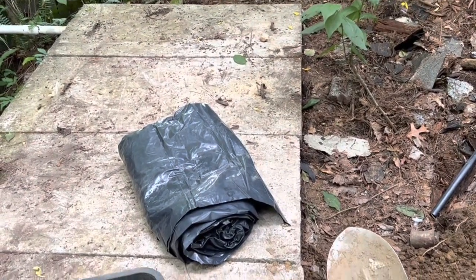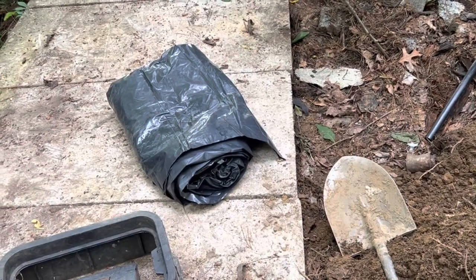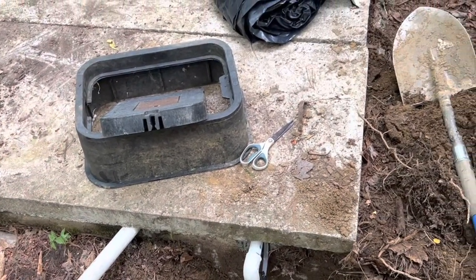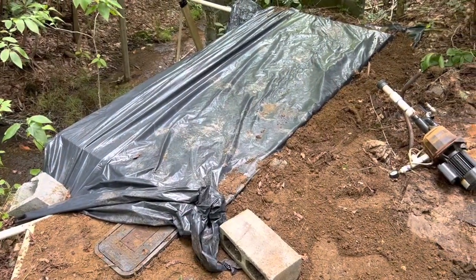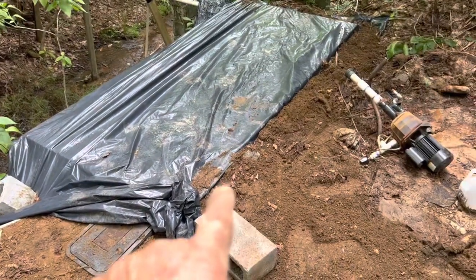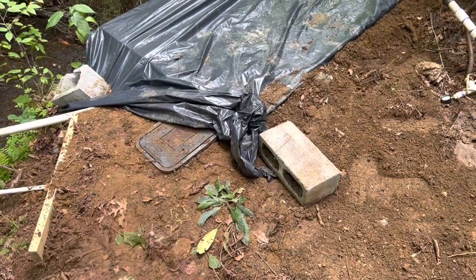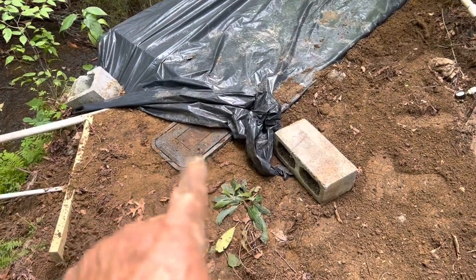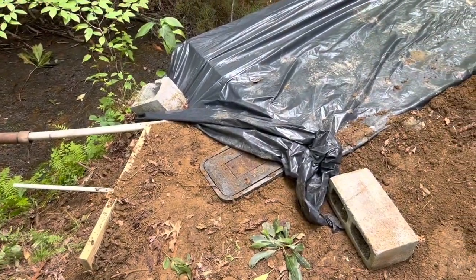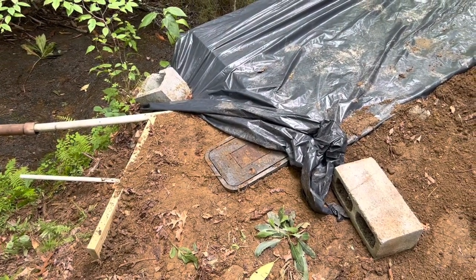Being we've cleaned the tank, we're going to finish digging around it, cover the whole thing with a couple layers of black plastic, then probably try to come up with a heavier cover on it. We've got the box all swept off, plastic put down, dug a ditch around it, and backfilled it with dirt so critters can't get in. There's a vault here with the pipe and valve that opens the drain. In wintertime, if they want to shut it down, this will drain the cold water line from the house all the way down to here.